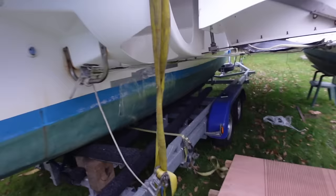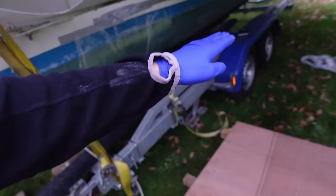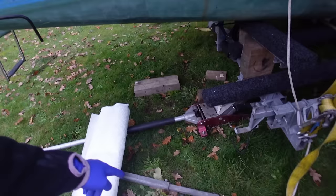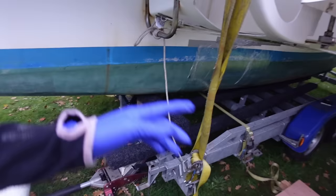We're also gonna add a peel ply, so we're hoping the peel ply, somewhat dry, will be able to slide underneath without sticking. And then we can do our jacking. We've got jacks galore, adjustable posts, so we can use those blocks and pull it up when we get it underneath. So we're just gonna get to laminating, slide it all in, and you will see that now.